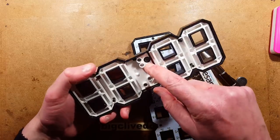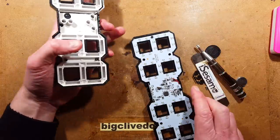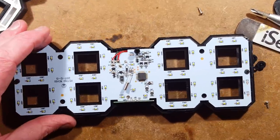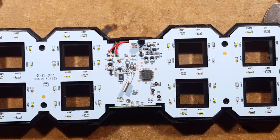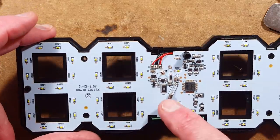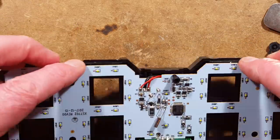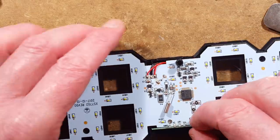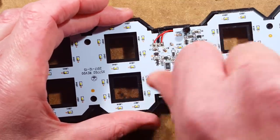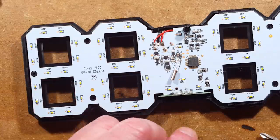It appears to be a glued pin — it's burst, but it doesn't really matter. Interestingly, there's a little dome on the front — does this have remote control functionality? Anyway, what do we have here? We have a microcontroller. Getting in closer, the LEDs are just surface mount LEDs — you could change them. There are two per segment, there's a little crystal here, and there's the microcontroller. There are little wires going off — that'll be for the power supply. Here's the little switch circuit board.